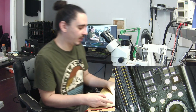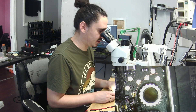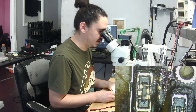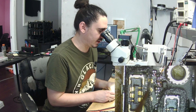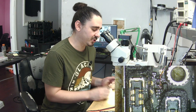Hi, this is Aaron with iBoard Repair and iPhone Data Recovery. Today I'm working on an iPhone 8 that's in for data recovery, but the customer requested that the phone works afterwards. This is a common problem on the iPhone 8 — these are battery data transistors, and when you unplug the battery with your fingernail you can knock these off, causing the phone to be stuck at one percent and not able to read battery data. I keep seeing jumpers attempted around this problem, but you need these transistors to read the battery data. In this video I'm going to show you how to properly repair this.